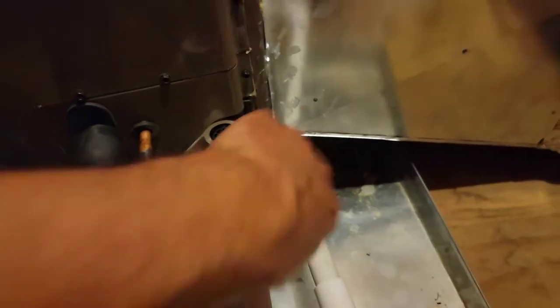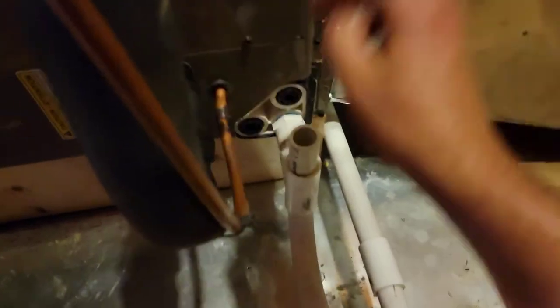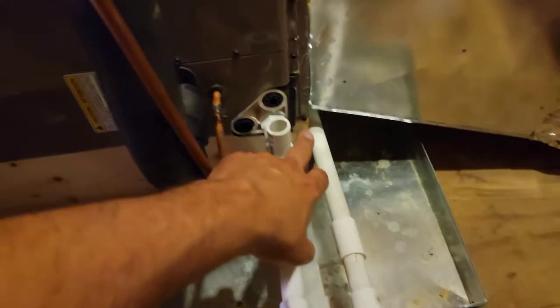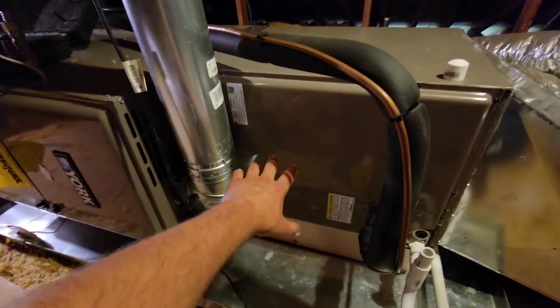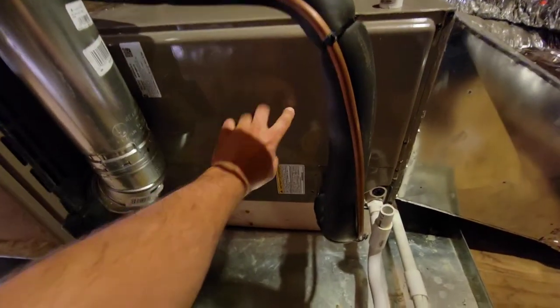Make sure that your drain is cleared — you might have to get some nitrogen or a little CO2 device that you can put right here, push a button, and it'll blow through the drain. Also, what can cause water in a pan is not just a drain being stopped up. It can be refrigerant being low, coils freezing up, and when it thaws out some of the water drops outside of the evaporator coil pan.